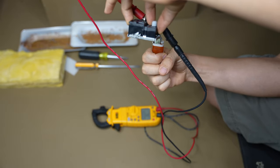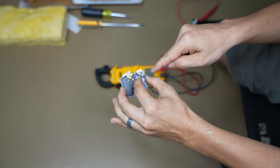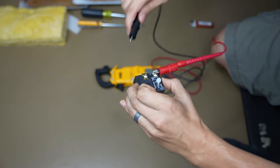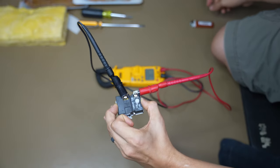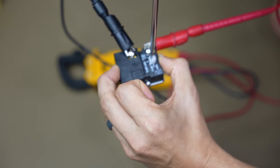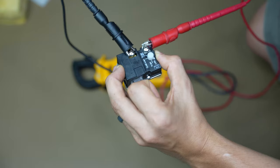There it goes — stopped beeping. Now as this thermostat cools off, the little bimetal disc will cool and snap back, and the meter will start beeping again. Or, if we turn up the temperature on the thermostat, that should cause it to turn back on as well. See that? And if I turn it back down, it turns off. That's because if we want it hotter, it takes longer for that disc to pop. Now let's take this apart and see what we have inside.